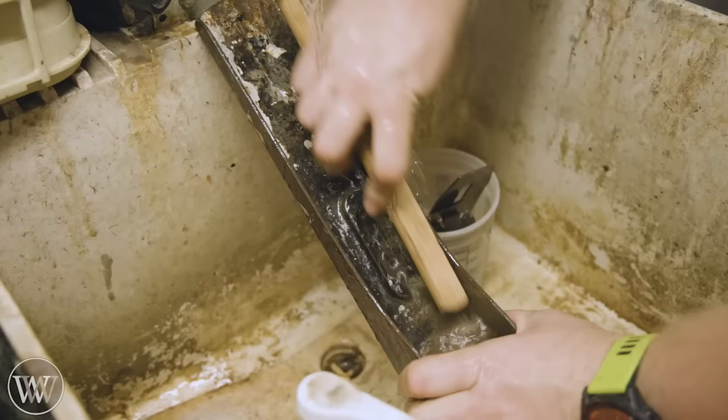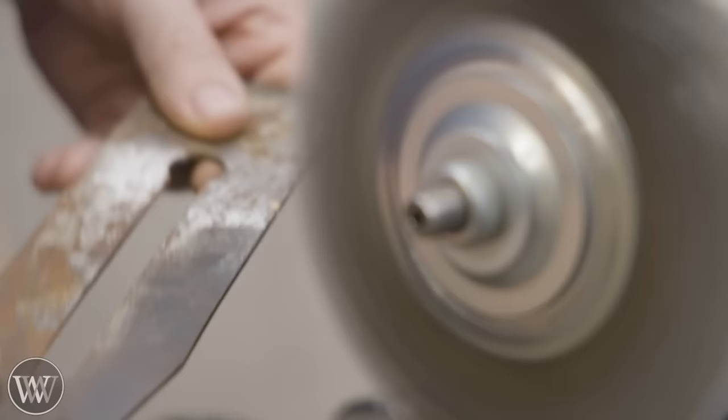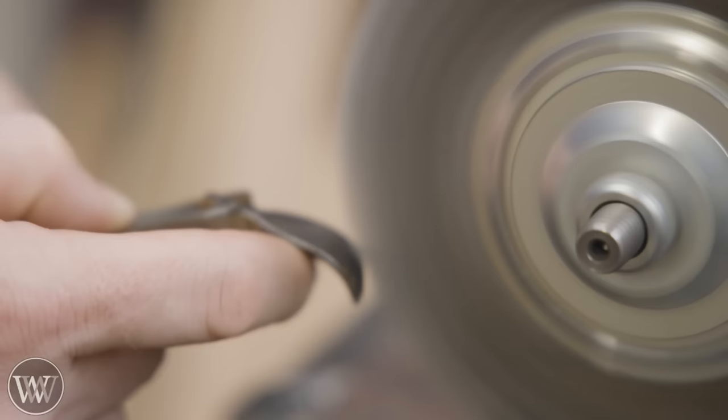The more I'm looking at this Japanning, the more I'm realizing there's just not as much there. Usually I'm going to try and leave it alone, but in this case I'm going to have to take it back a good ways. Most of this I like to remove with the wire brush. Having the wheel on here actually goes really quickly and leaves you with a decent patina afterwards. It doesn't completely tear it down, it just gives you that nicer look you're going for.